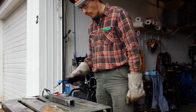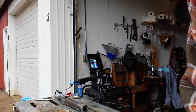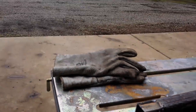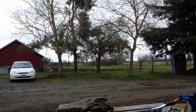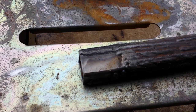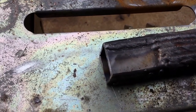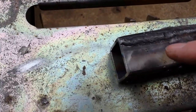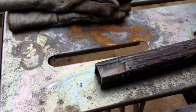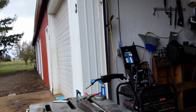That went much better than I expected. Let's see if I can get you a close-up of this. So that's the weld as it laid down — let's get that cleaned up. Not too bad. It's not great — I see what looks like a little bit of porosity in there, but all in all, not too bad. You can see the heat-affected zone is clear back here and on the end here. From what I'd seen, I expected that to be much worse. There's not nearly as much spatter as I would have expected.